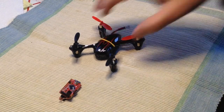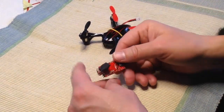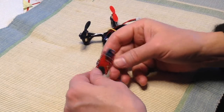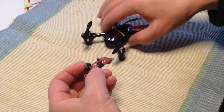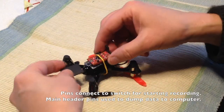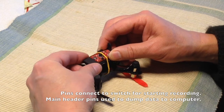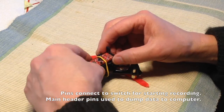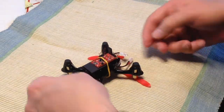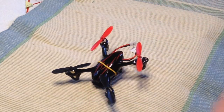So here's the little device — that's the drone and the altimeter. The altimeter has its own battery and the BMP180 module connected. I just strap it on the bottom with a rubber band. I put a little sheath over the pressure sensor to protect it from light — it's light sensitive — and protected from dirt. And there it is, ready to fly.